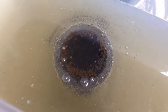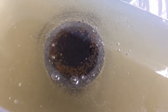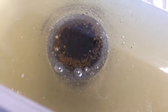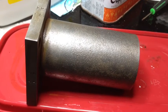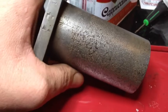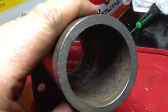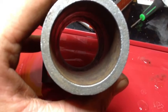This is a couple hours later. You can see the change — rust coming to the top, and a little bare metal coming up on the other side. It does break down the surface of the metal, so you have to be careful. It's bubbling away, cleaning. It's coming along — almost got it; going to put it in for a little more. You can see it's got most of it but this one area where it was rusted the worst still needs work. The bore still has some junk in it — I'll run a hone through that later. The main thing is to get rid of the rest of the old rust.